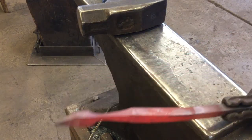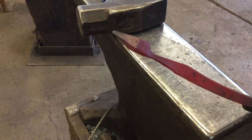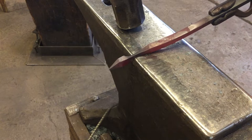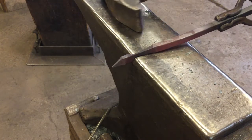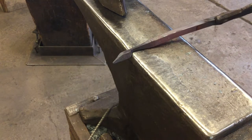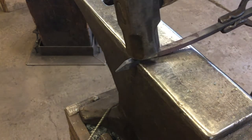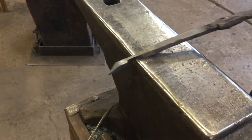If you look closely, we've got our neckline here and it's isolated very smoothly. You have to remember that each time you're forging, before the hammer comes down for that half-face blow, I'm actually pulling with my arm to feel that shoulder of the leaf seated in with the edge of the anvil. That shoulder is what allows the body to feel that we're at the same place we need to hit every time. Although when you're forging it looks like you're alternating left to right, on an exaggerated fashion it looks more like this: pull, lock, hit, turn, pull, lock, hit — but on a much smaller scale.